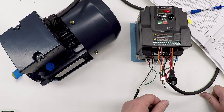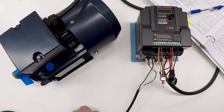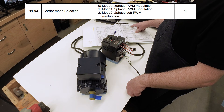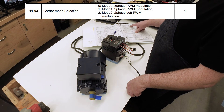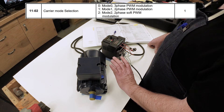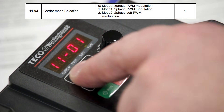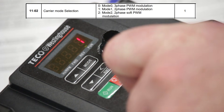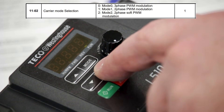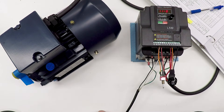I can still hear it but it's very high at 16 kilohertz now. There's another setting for carrier mode: three-phase pulse-width modulation, two-phase modulation, or two-phase soft modulation. The manual says the default is two-phase; I'm going to set it to three-phase. That will energize all motor coils simultaneously, creating a rotating magnetic field and making it run smoother. Setting 1102, long press — it's set to one, which is two-phase PWM. I want to change it to zero, which is three-phase. Long press Enter, check it's still there — yes, still zero. Long press to confirm.